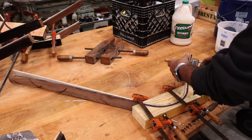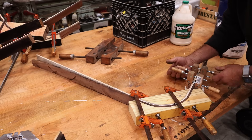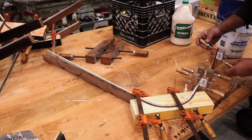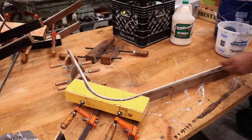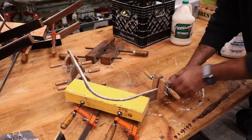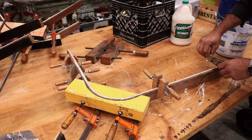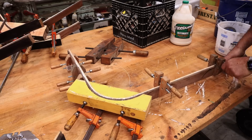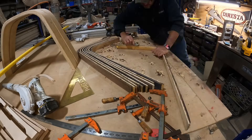I've got to make sure all the slats are glued together. I'm using these little screw clamps, hitting them from all directions. This glue session turned into all clamps on deck — I'm having to find every single clamp. When you steam bend wood, even though those slats are only two inches, they cup, they pucker, they twist, they turn. So it's important that right now I'm gluing them and making sure that everything is as straight as I could possibly make it.